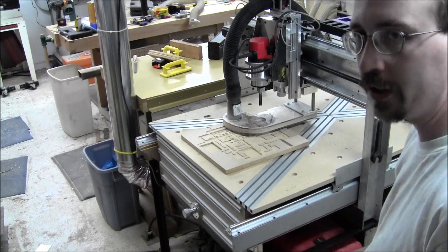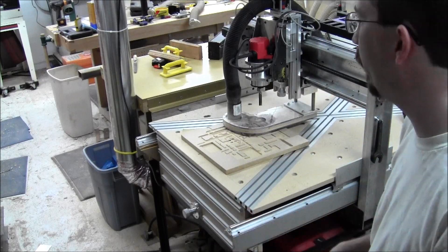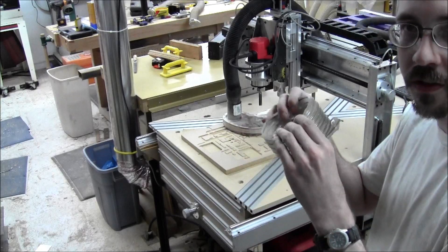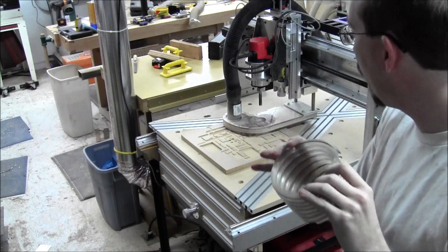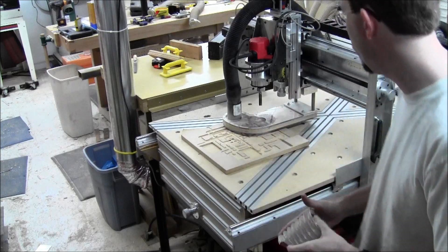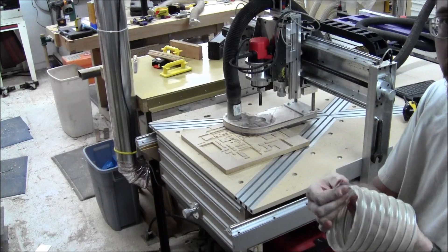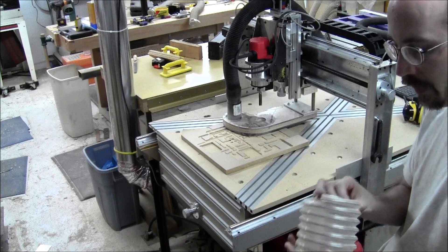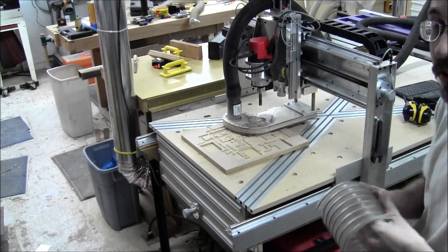I don't think the suction is being restricted any. It's just a matter of there's so much chaos from a spinning bit and dust flying all over that it's hard to catch it all. The best thing I can do is contain it. This thing is pretty stretchy, but it takes a fair bit of force to get it that low — not enough to make me worry about the structure of the dust port. I would love a little more flexibility. I've seen some that uses a thinner membrane; this stuff is fairly thick. If I can find some that's clearer that would be even better, but I'm skeptical since this stuff started out clear as the polycarb.